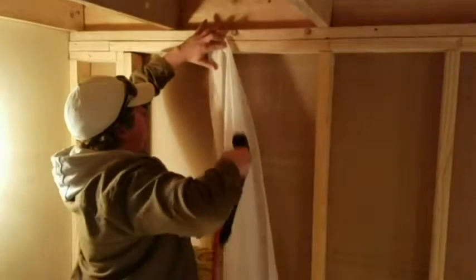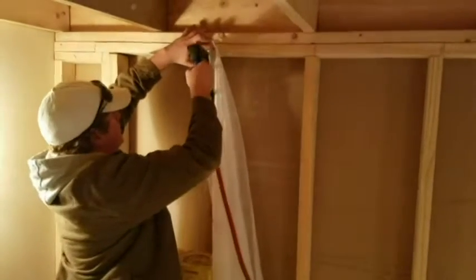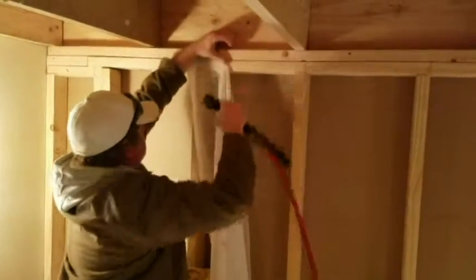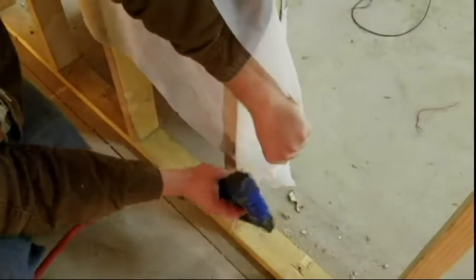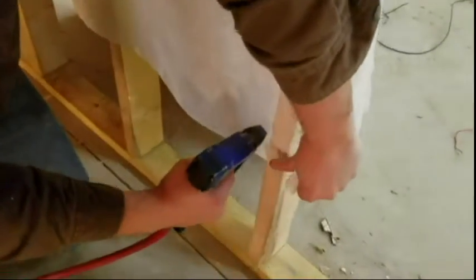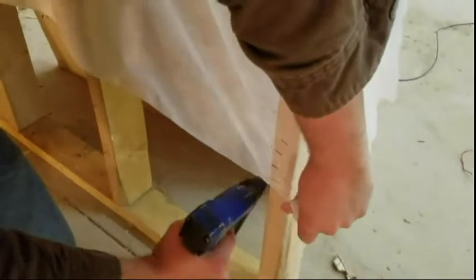While there's no method that has to be followed while installing a fiberglass insulation blanket, there are a few steps you can take to make the process a lot easier on yourself. First, we're going to tack the top left corner of the blanket to the wall. Then we're going to climb down the ladder and tack the bottom right corner. While you're stapling it, you need to pull as tight as you possibly can without accidentally ripping any of the staples out. This way, when the blanket is done being tacked on the wall, it'll lay completely flat.